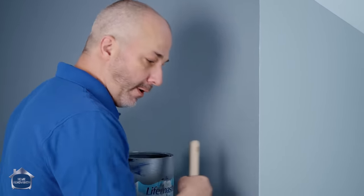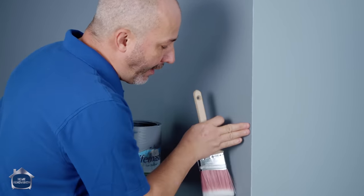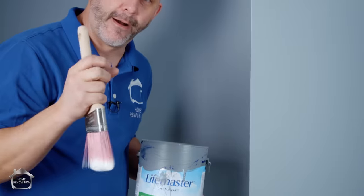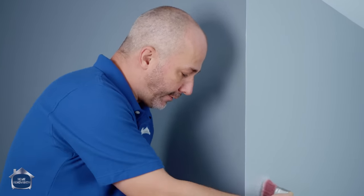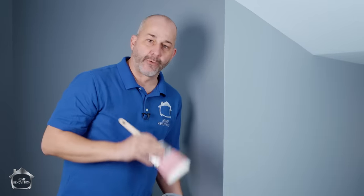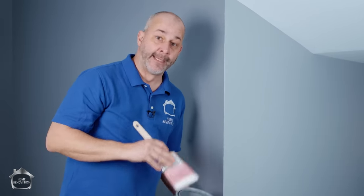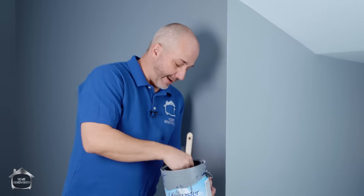This is an outside corner of a wall, okay? The light color paint has been run against this edge by the bristles on the nap roller and what it does is it creates the effect where you have one color here, one color here, and then a white skunk line right down the middle at different times of the day, and that screams not professional. If you're gonna paint your own house, don't skunk your corners — I'll show you how to fix it.